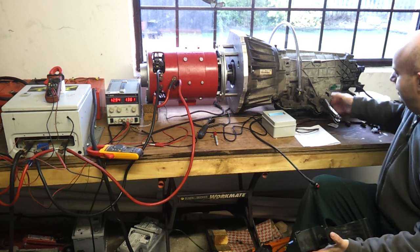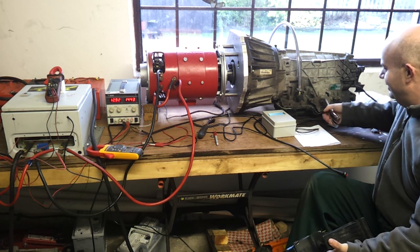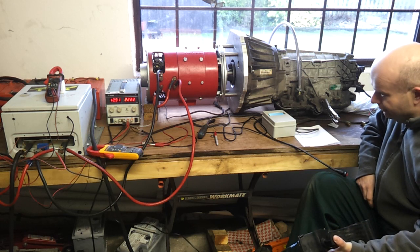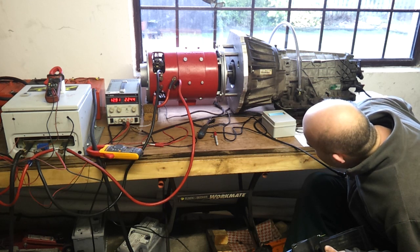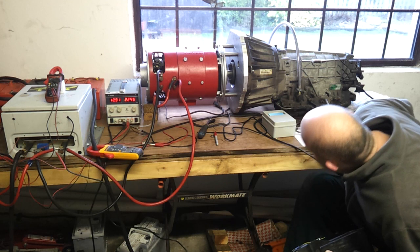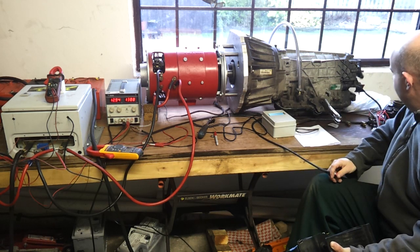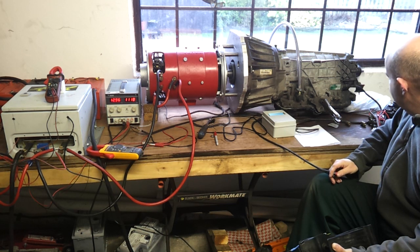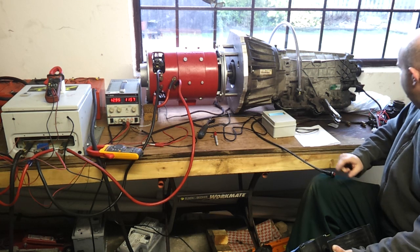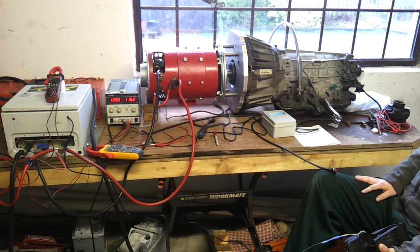Let's pretend we're semi-professional here. Neutral - let's bring it up to a little bit of idle speed. A couple hundred RPM is enough to bring up the pump. Let's pop into drive - there's drive. Let's do an upshift at slightly higher RPM than before. There's second, third - fourth is not the best, here comes fifth. There's a little bit of lag in fifth gear but maximum throttle - fifth gear - that thing is perfect. We're definitely cruising now. Up to 15 degrees oil temperature.